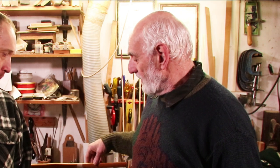This is part three. The other videos — if you haven't seen them, I suggest you do, otherwise none of what just happened or what you're about to see is going to make any sense whatsoever. We have been looking at this self-yew bow that is here behind us on the bench. The customer has had the bow for about 20 years. There were a number of very small lifts on the back of the bow — the sapwood side, because this is a self-yew bow — which under the magnifying glass looked horrendous. We've scraped the back surface because we thought if we can scrape some of that sapwood away those lifts might disappear, and they seem to have.